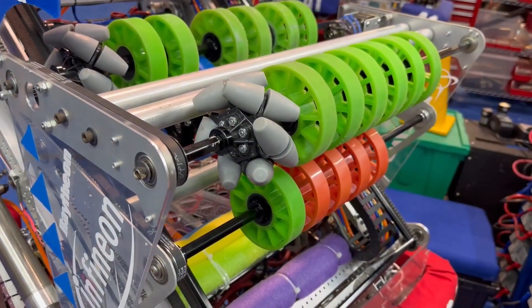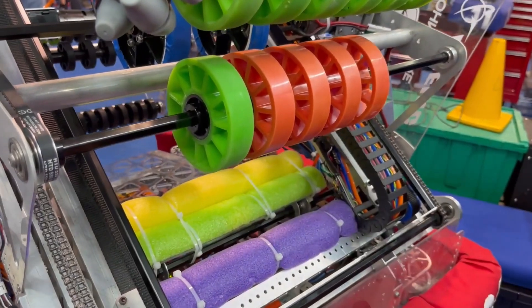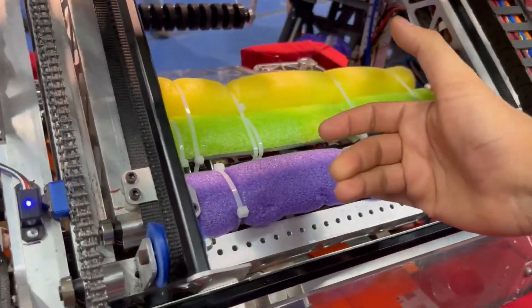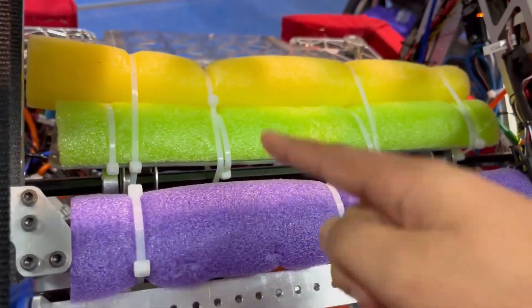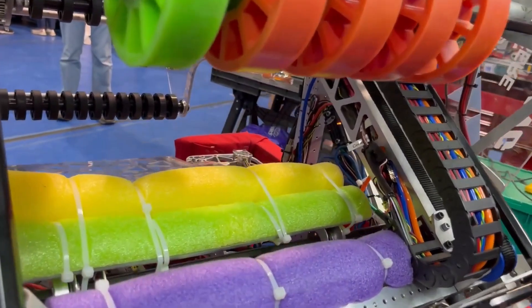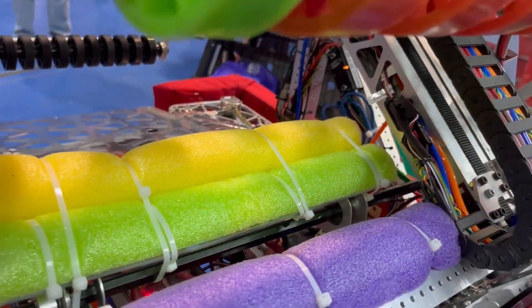The first two are pretty squishy compliant wheels, and they have two mecanum wheels on the side that help vector the cube towards the center. We added higher durometer compliant wheels to the middle to help with some of the compression issues we were having. The pool noodles on the bottom close the distance between the bottom of our robot and the top of the flex wheels to have more compression and make our intake more consistent.